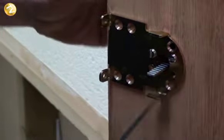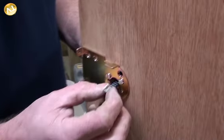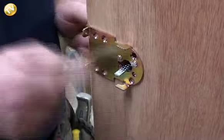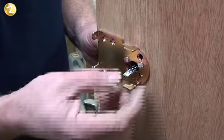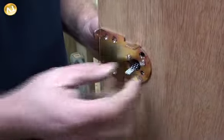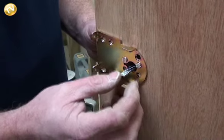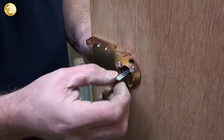That's home there nicely. As you can see on this barrel, the bar that comes through has got little tiny notches on it. When you go to put your lock on, if your door is thinner you'll need to cut these down with a hacksaw. If the bar is sticking out too far the lock won't push home. But obviously the door we're using today is ideal — the bar is coming through the right amount.